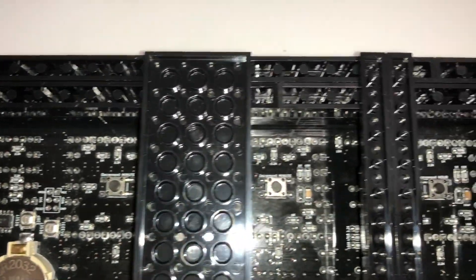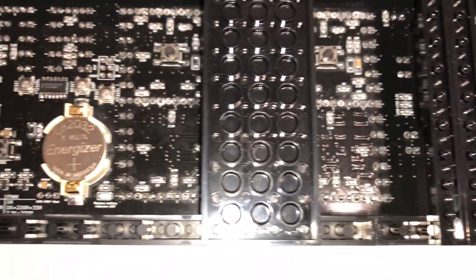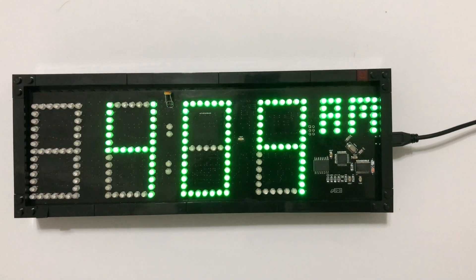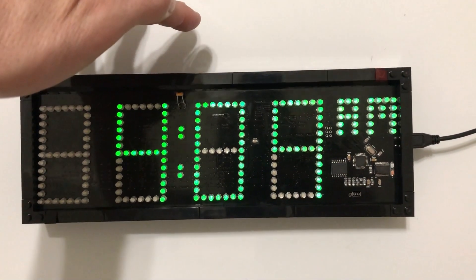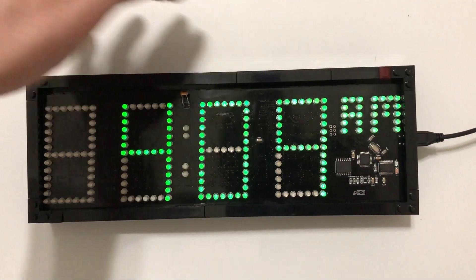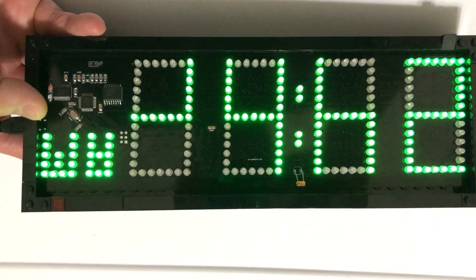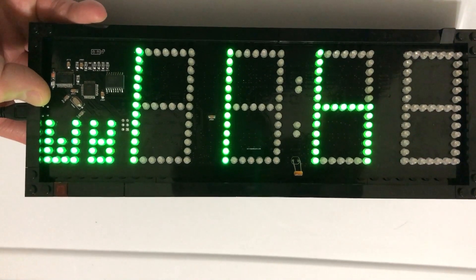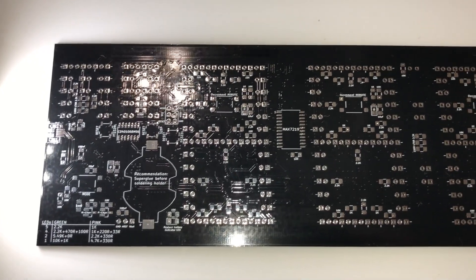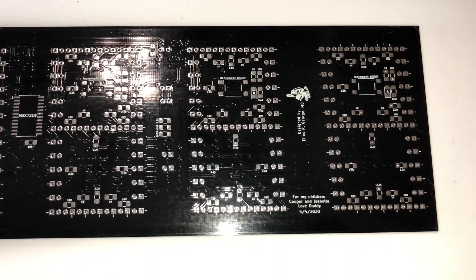Since it was for his kids' room, he added a little LDR circuit to dim at night. He added 12/24-hour button switching, and since it was only programmable from the computer before, he added up-down buttons to increment and decrement the hours and minutes. Since he had a few pins left on the Atmega, he decided to put in a battery checker - it checks the battery voltage twice a day using the internal voltage reference on the Atmega. All the buttons are hardware debounced using a CD40106BM96, an inverting Schmidt trigger. And because a good doctor likes Legos, he built enclosures for both clocks out of Legos.